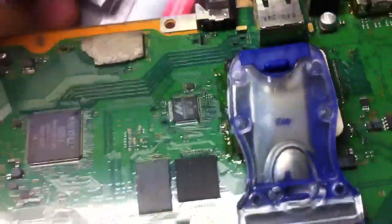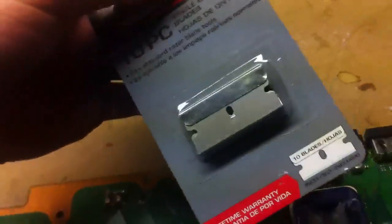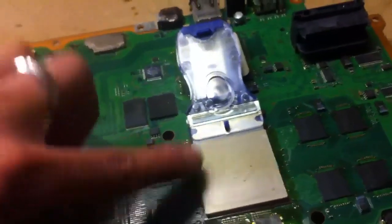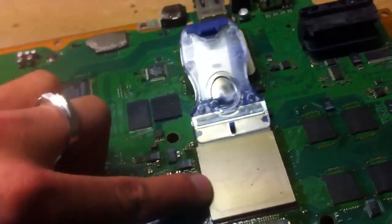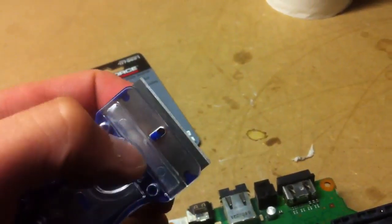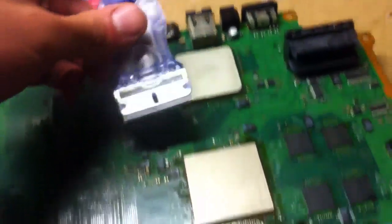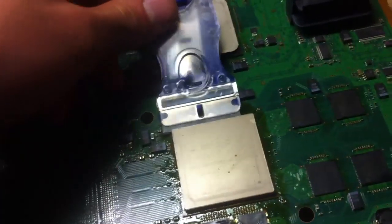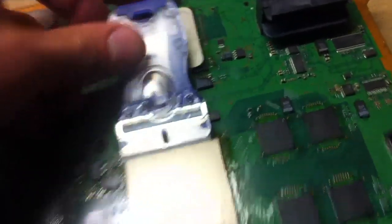This method is probably the easiest I've come up with, using those flexible razor blades. Because they flex, you can get them in line with the chip so you don't cut it. There are stoppers — pieces of plastic — that keep the blade from going all the way in and damaging the die.